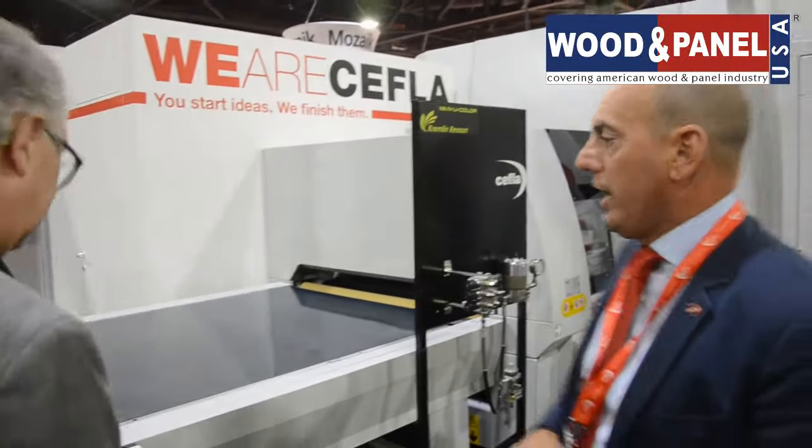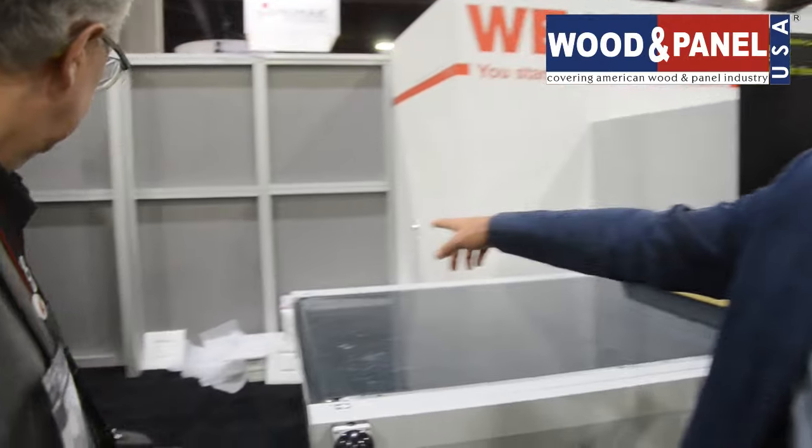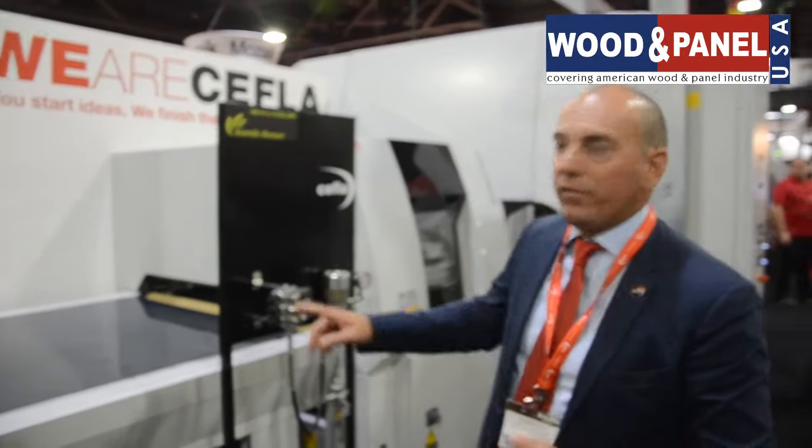Here we have a complete working line which is utilizing a spray machine that is a step above the Mito 2P — the Easy — again with two arms, a machine that is more productive because it can go faster, spraying faster, so more volume of production in linear meters. It's a machine that comes with the CFP belt, so it always reclaims what I am overspraying. This is a functioning line so we're doing real demos here, with pre-base-coated panels and we are doing the finishing on this machine. The line is equipped with a brushing machine.